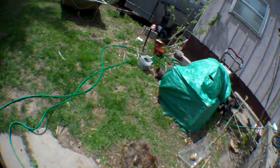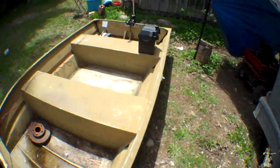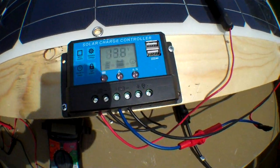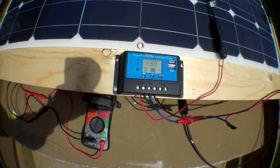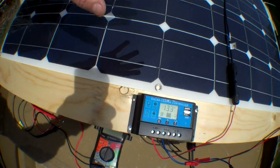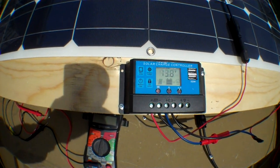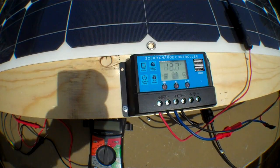I've left it running for half an hour now. It started at 12.5 volts, and it's in pretty well full sun. Seems to be charging pretty damn good. From 12.5 — I'll put my hand over it and it changes things a little bit. Take it off — full sunlight just charges the heck out of this thing. So yeah, I can run the motor all the daylight hours; it just keeps charging. Awesome.